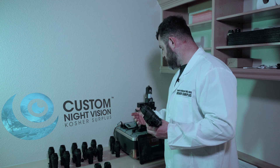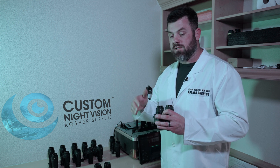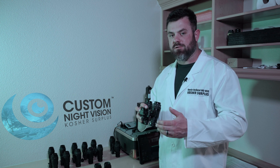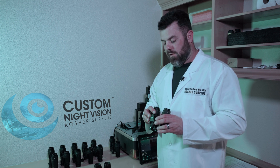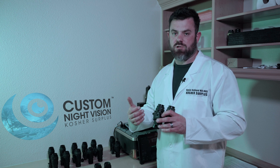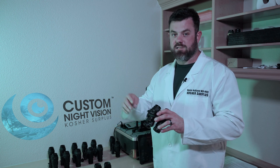What that offset allows you to do is turn the eyepiece — with the diopter set to zero — put the binocular on this machine, and turn the eyepiece until a crosshair or two crosshairs intersect and overlap one another. Each pod will have an optical centerline that rotates in a circle on top of an image inside of this machine, and you want those two to intersect. You need to find the optimal point of intersection — the best place is when those two circles intersect at the point closest to bore-sighted, or the center of the perceived image you're receiving through the eyepiece.